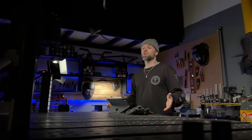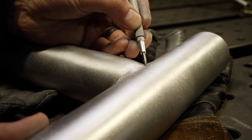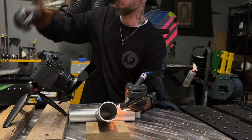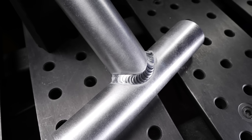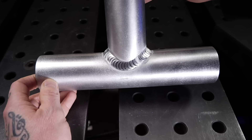Now we have a blank slate — we can do our cosmetic welding over top of this and make it look great. If you want, you can scribe out a line to follow, but at this point it should be pretty straightforward. Plan how you want to position your piece and which direction you want to weld. When you flash up and get going, make sure you get it hot, get a nice puddle at the start, and match the heat with the proper amount of filler. Working around a piece of pipe like this is a lot of fun and you can get creative with your TIG welding. Taking a look after finishing the welding, we have a joint that looks just like a coped pipe joint, and we've dealt with the gap almost as if you can't even tell it was there. The alignment stayed 90 degrees and flat, and the weld over the top looks great.